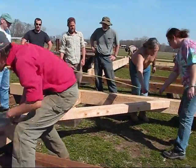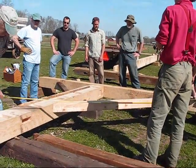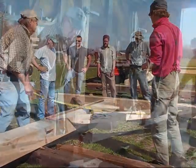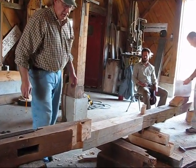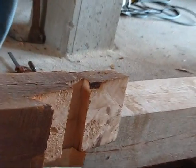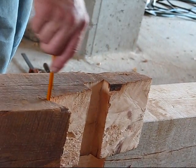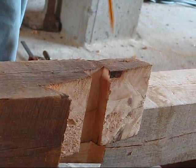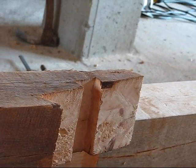When it's square, here's how you check your square: three, four, five — this should be ten right there. And you're just a half inch away right now. It's inset from the edge, both edges, a nominal inch and a half. And then this is a 45, and this just connects the two 45s.